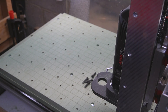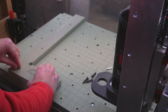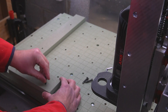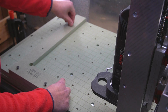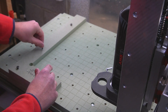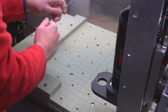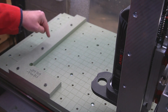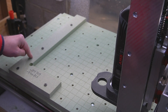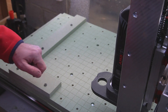So, how do we use our new jig? The first thing to do is to fix it exactly at the same place. By using those tapered screws, if I use the same holes in my wasteboard, I will be exactly at the same place as before because the taper in the screw will center the hole of the jig. That's the first step. Now, as we have cut this cutout with the jig fixed the same way on the wasteboard, we know this is exactly square and parallel with the sides of the machine.